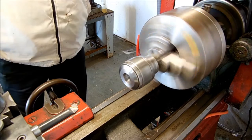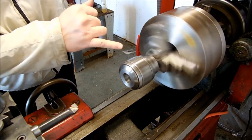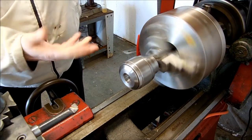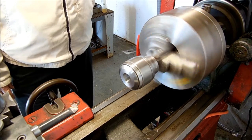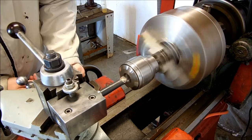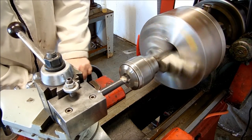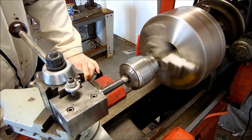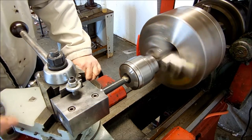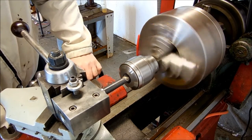You can see there's still a little bit of runout on the outer body and even in the hole itself, but it's a lot less than it was when I was holding the drill chuck by the head. You can actually see there's no runout in the front of it. I can't go any deeper on the outside because the inside is tapering down and it'll just push the tool back — it's not moving, it's just bending. That's a boring bar for you. Kind of a shame; I guess I need a carbide boring bar, something stiffer.